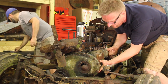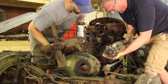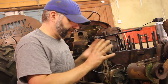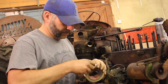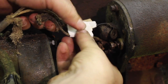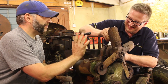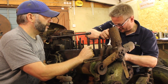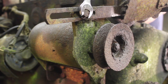The injection pump is ready to come off - just a little wiggle and it's free. That looks clean! Injector pump off, time to crack on. Even though there's not a massive amount of wiring on the tractor I still like to label all the wires up - just a bit of white gaffer tape, torn off, bunged on the wire, and a marker pen to write what it is. That injector came off like a dream - all the nuts came off really nicely. Even the water pump and the dynamo are just coming away really nicely.